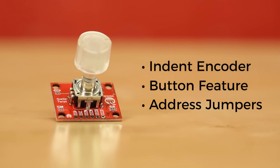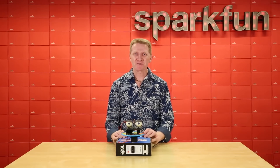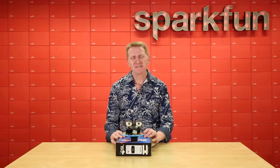There are also address jumpers, but you can also change the I2C address of each knob via software, so you can use up to 111 of these at once. We've included a library and a couple of handfuls of examples to get you started, and using this as a simple drop-in for any of your potentiometer projects is really simple and so much cooler.